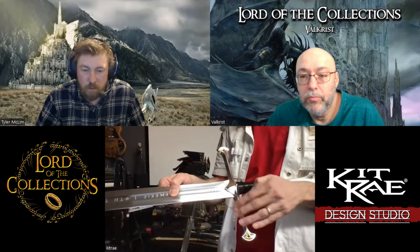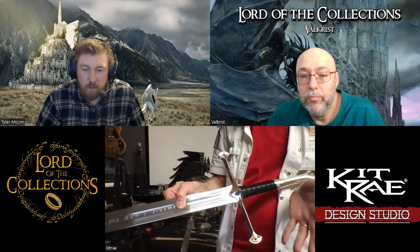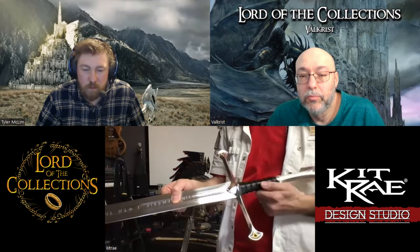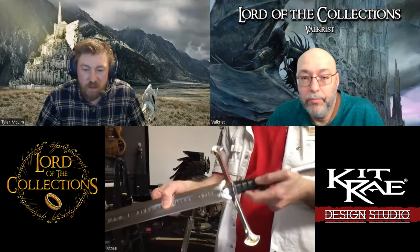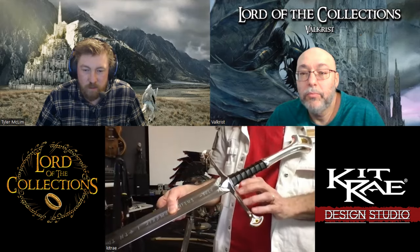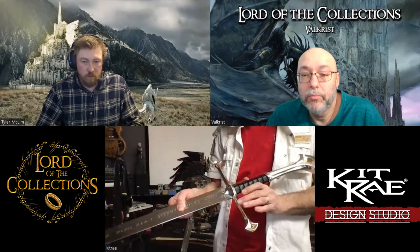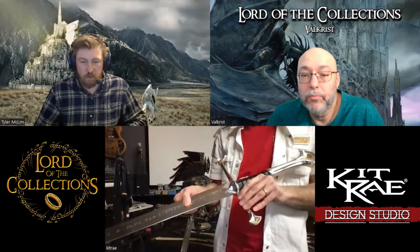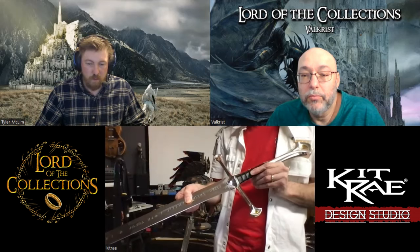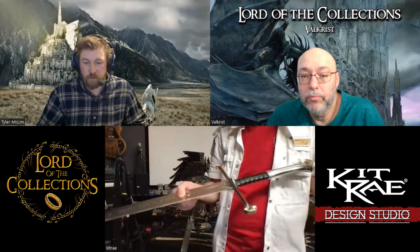So this is that same tooling, but you can actually polish it. You don't even need to plate it. You can polish it and it looks just like steel with no plating. It will oxidize, but so will steel. So that museum collection version is going to require some maintenance. If you let it sit there for a couple of years with people's fingerprints all over it, you're going to have to get some Metal Glo or Flitz or some type of polishing compound to deoxidize it and remove that, or keep it polished up, or just put a wax coating on it.